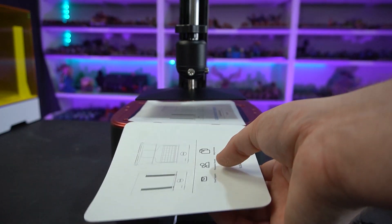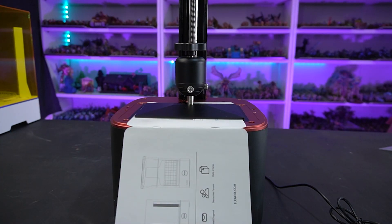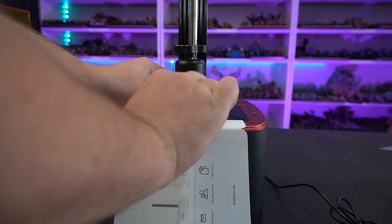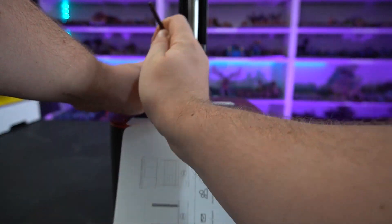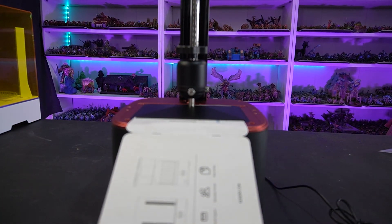You loosen both screws, put it onto the machine, set the machine to home with a piece of paper over the screen, then press down and level the screen and tighten it up with the Allen keys. Then you raise it by 0.01mm to allow you to remove the paper with mild resistance rather than tearing it. And then you're ready to print.